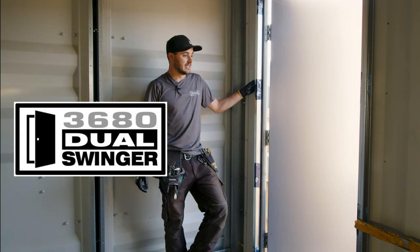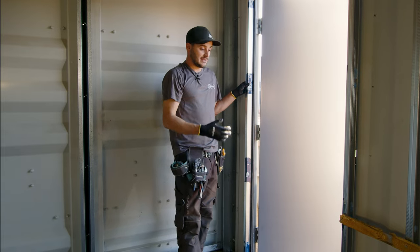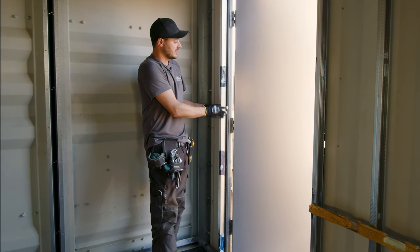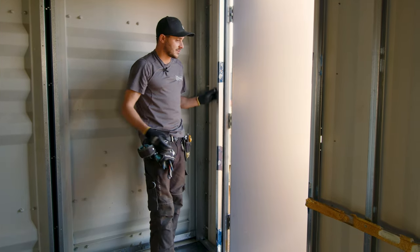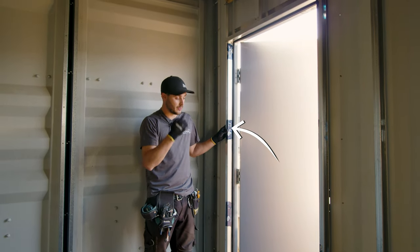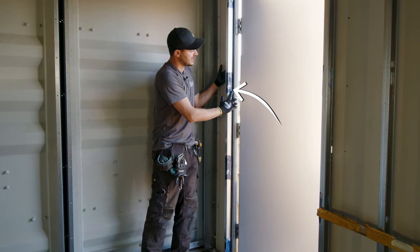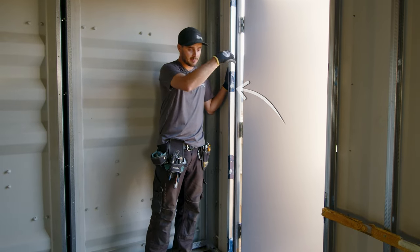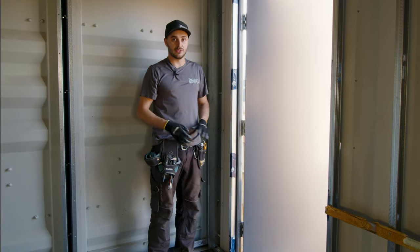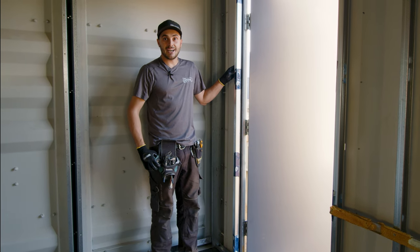With the container modification world man door, not having a hollow tube frame means we can spray foam right up to the door frame and get as good an insulation value as possible out of any commercial door, while still providing a finished steel stud to trim back up to the automotive-style door seal. We've also tucked tape over all the electrical holes around the doors and windows to stop spray foam from flying through. Consider using stucco tape — that red vinyl tape that doesn't leave residue — around doors so foam doesn't escape and stain surfaces. Lay poly down prior to foaming to protect anything that won't be finished after spray foam.